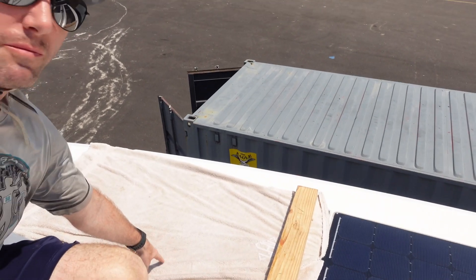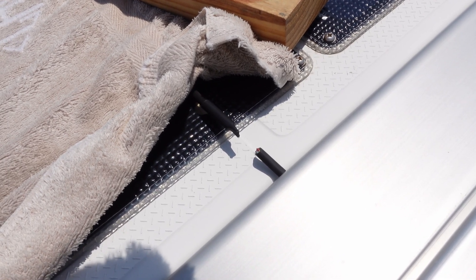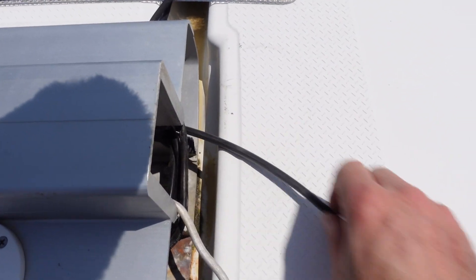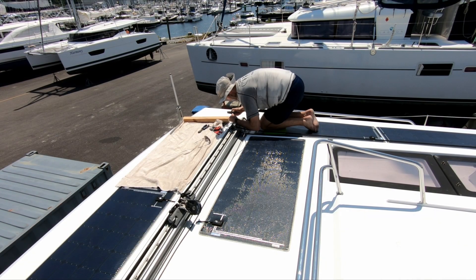I'm going to start with the starboard-most solar panel. I want to disconnect that and make sure the wiring is going to be long enough to use. I've got the panel covered because it is a sunny day and I don't want power coming out of the panel as I disconnect it. The wire is cut and I put a little bit of heat shrink on one end just so there are no live wires out there, and now I'm going to pull that side through the traveler. The big question was whether this wire we just cut would stretch far enough along the traveler to splice in another solar panel — and I'm happy to say it will. With proof that my plans could actually work, I felt a lot more confident starting to cut the remaining wires and move things around.